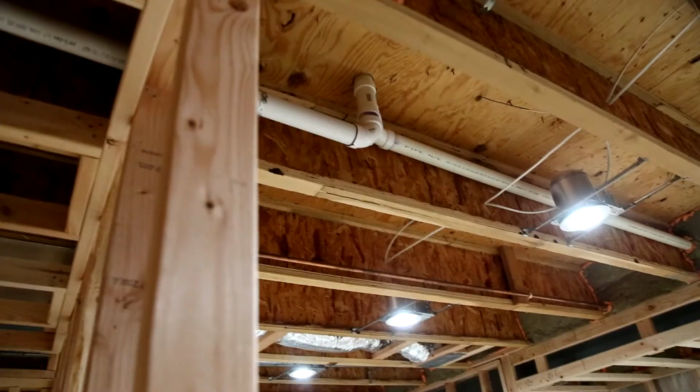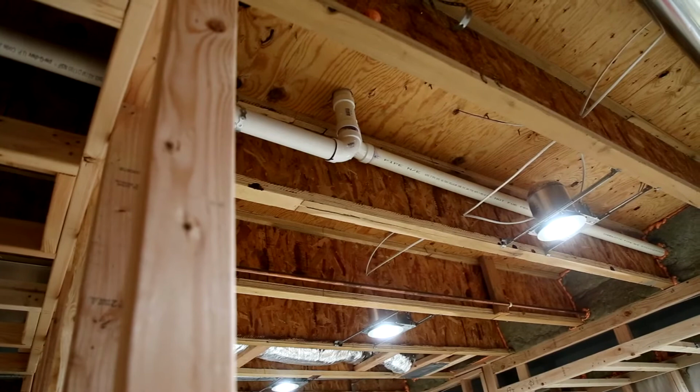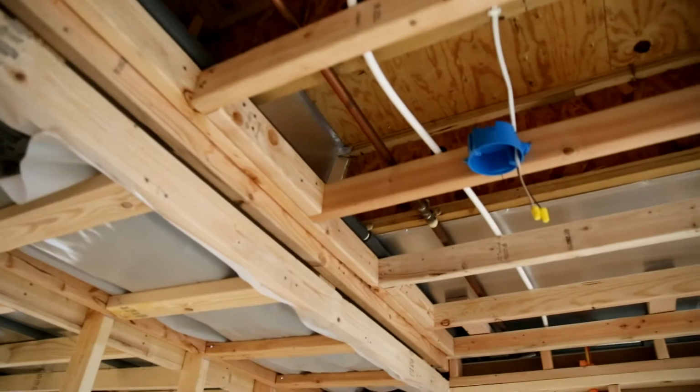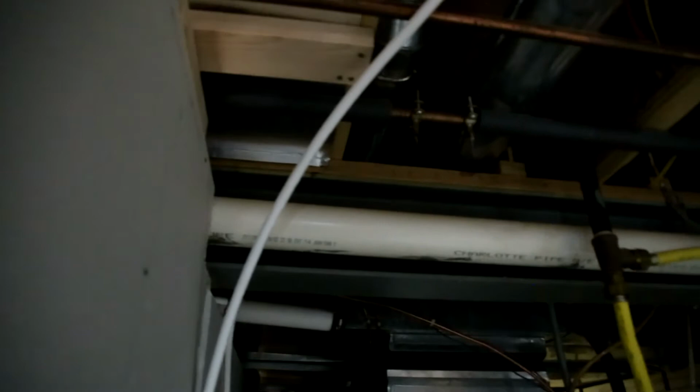So here's a vent stack. It was originally built in the basement. They had it roughed in for a powder room, sort of in a really not terribly useful spot. So here I tapped into that vent that comes across over the ceiling of the wine cellar that is angled sort of down as it goes underneath. Then it runs along the steel carrying beam over here to the back behind the wine cellar in this mechanical space. We can actually look out here up to where that vent comes in, temporarily capped there.